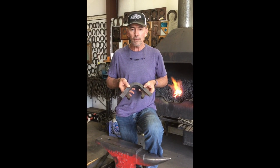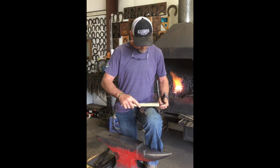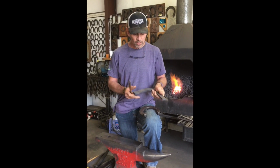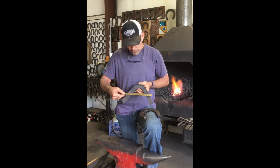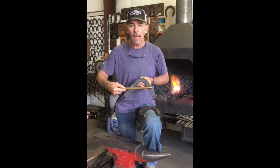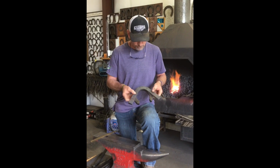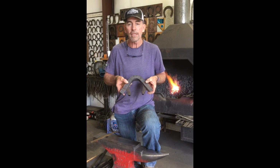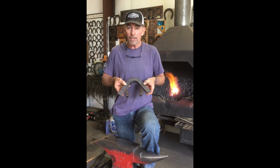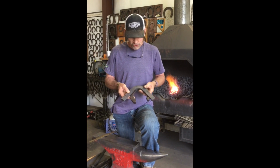And so if you have a foot that is, this shoe is about 6 3/4. Well, when you go halfway down your branch, you probably should be fairly close to that, because you're finishing out your toe bend on a hind foot almost to the heel nail. And if you do that, then whenever you make your quarter bend, you're not over bending your quarter bend, and then you're not jockeying around.